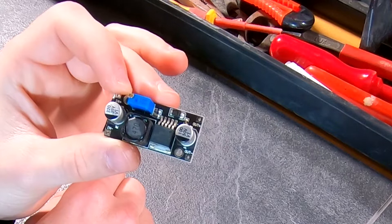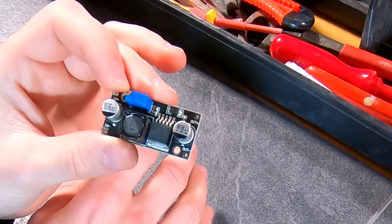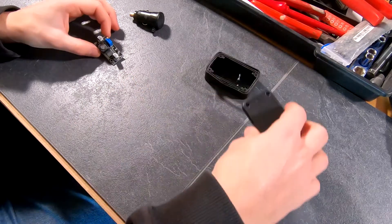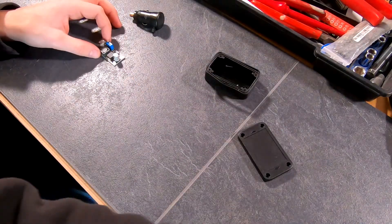The main problem is that the voltage of a car battery is 12V and my laptop uses 19V. So we need to figure a way to connect a 19V device to a 12V power supply. This little device can convert a low DC voltage into a higher DC voltage. I'm gonna embed it into this case and use different plugs to connect it to everything.